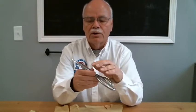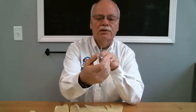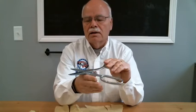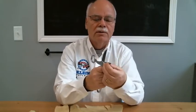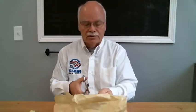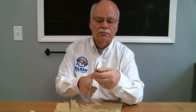The pivot itself is spring-loaded so that it keeps tension on the blade so that it continues to cut material as the edges wear. The edges themselves are serrated — you have a medium serration and a fine serration — and that holds the fabric material, which Aramids are prone to slipping on a normal tool. So you've got to have those serrations on it, and you have to have a low angle for durability.